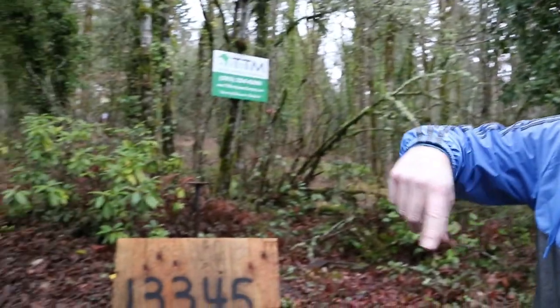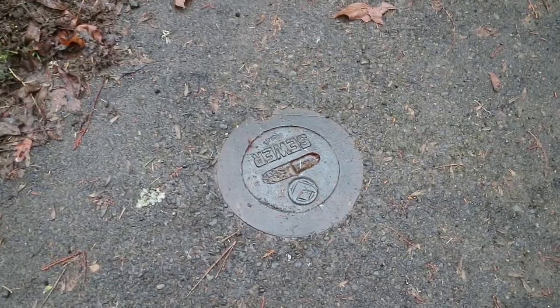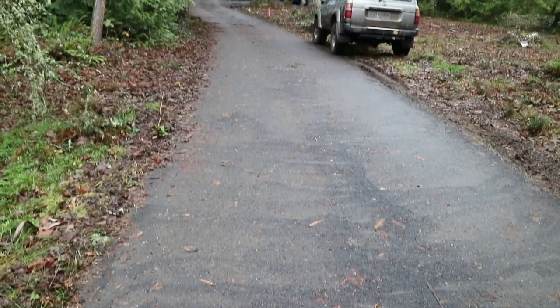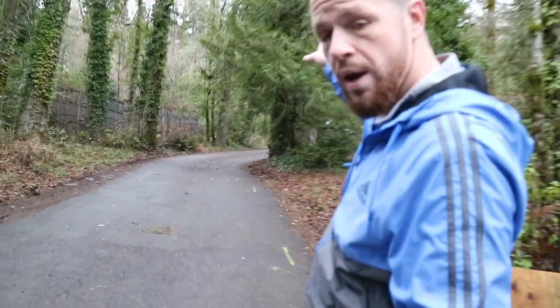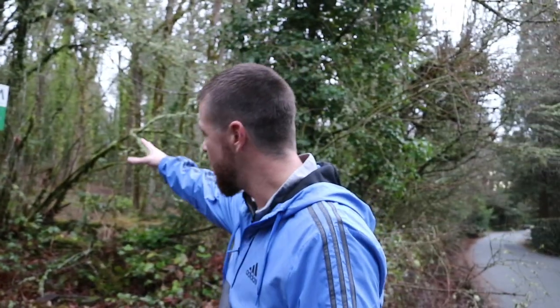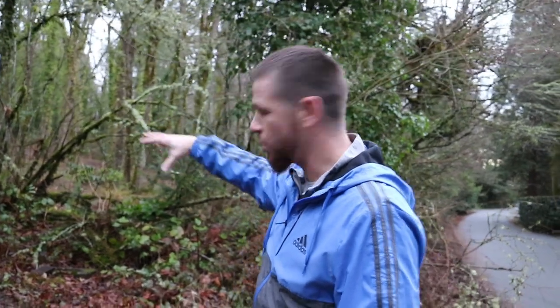What they did instead is put in pressurized lines. You can see three cleanouts right there — basically two-inch lines that pump all the sewage liquid uphill. It goes all the way up this driveway, up across the lot behind us, and ties into a sewer main way up on top of the hill. This is a very different type of sewer system than what you normally see in the Portland area. In Dunthorpe it's fairly common because of all the old houses, contours, and slope — they don't have mains on a lot of the lower streets.